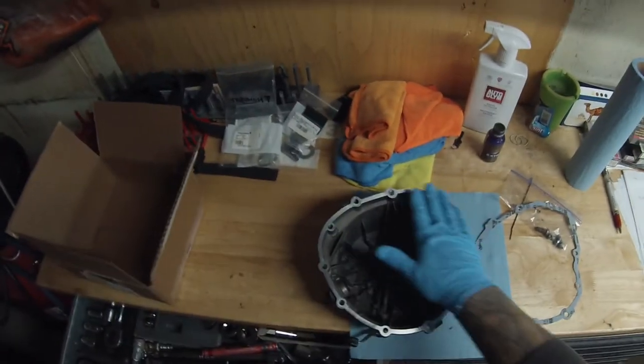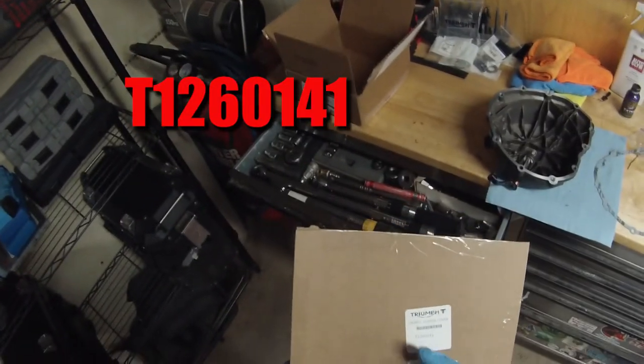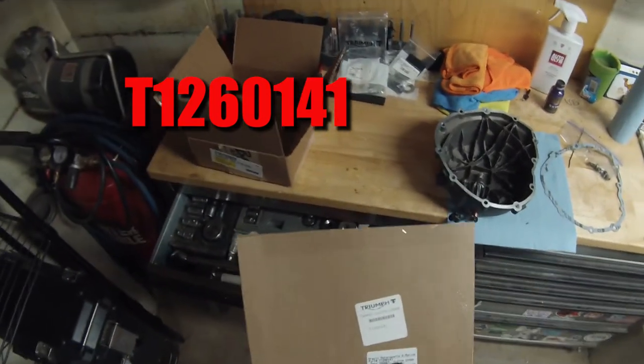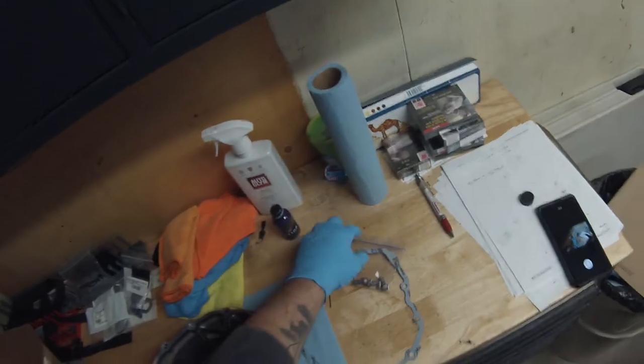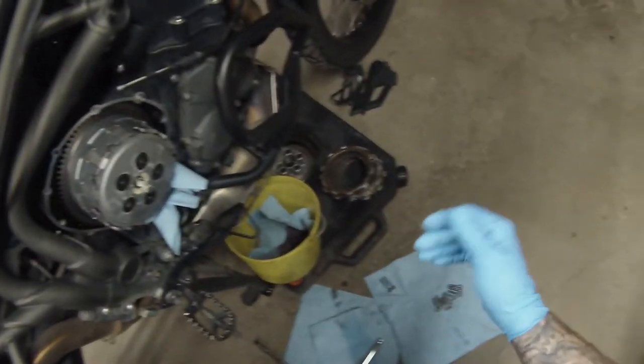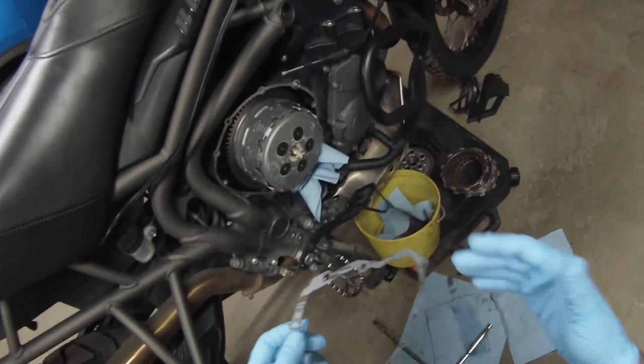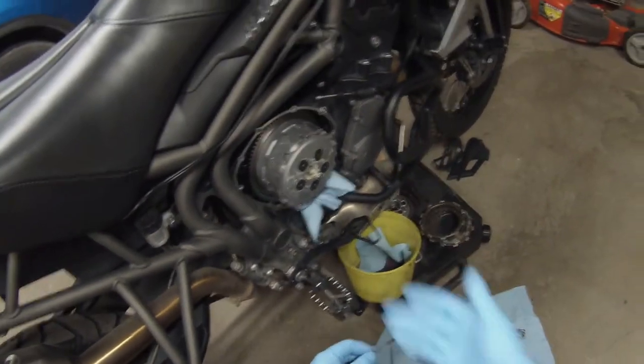Make sure to clean both surfaces well. This one here you're going to have to be a little bit careful of because oil will drip down — try and work somewhat quick. Give it a wipe, then we're going to put the gasket on. The gasket you're going to need is T1260141. Give the gasket surface a good wipe, get your bolts ready, set aside the two long ones so you can immediately put those into the ones with the dowels. We're going to put a little bit of blue Loctite on all those bolts. Once I get this gasket set on there, I'll jump back in for when we hook the pressure release arm.